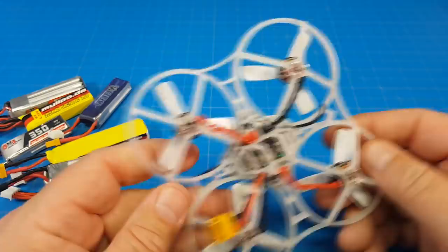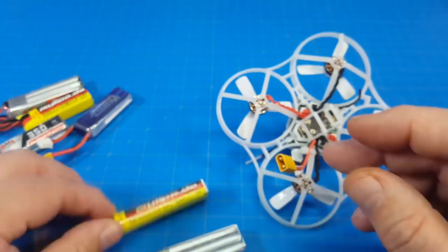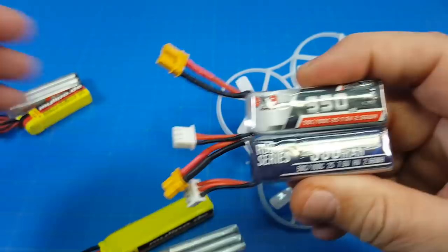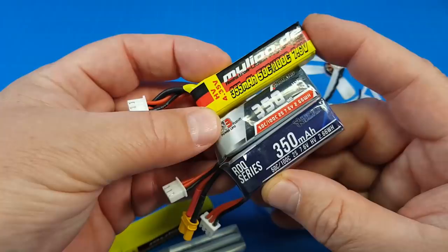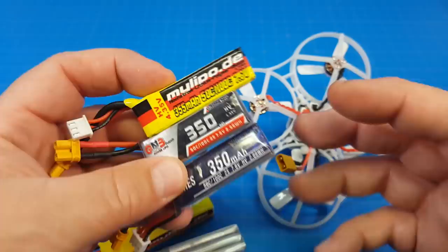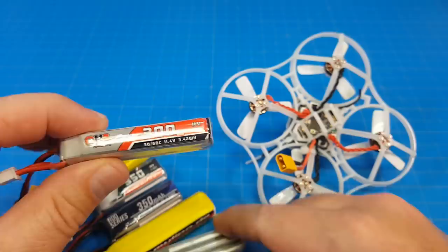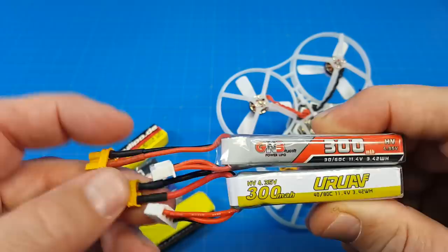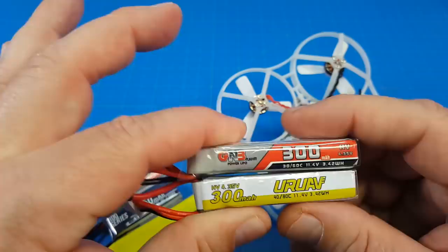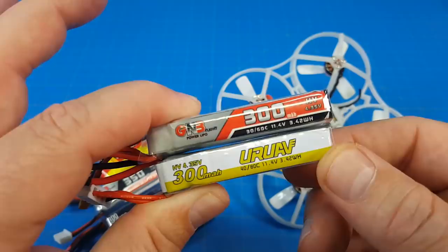So I want to bring to your attention — this is the stock battery that it came with, and then this is one of the batteries I spent a good amount of my outside time flying. Inside flights came on these batteries: GNBs, race day quads, and MyLipo batteries which come from tinywhoop.com. If you're looking for batteries, I do have links to all of these in the video description. The stock GNB battery is pretty much just like this one — the battery lead is actually a different length, so maybe they changed battery leads. I'm guessing GNB is making a lot more of these batteries because they perform the same, they weigh almost the same, and the resistance is very close. I'm leaning towards most of these 3S 300 milliamp batteries being GNB batteries.